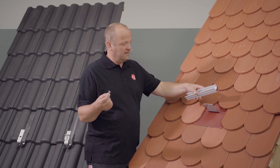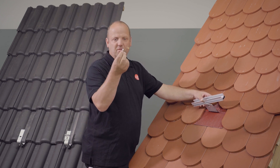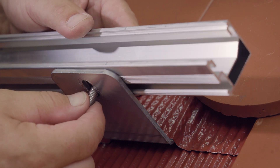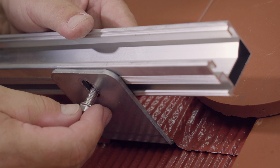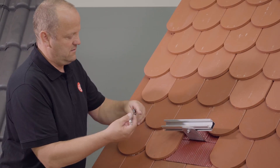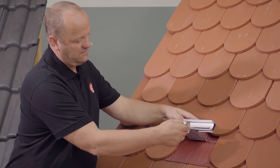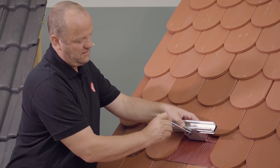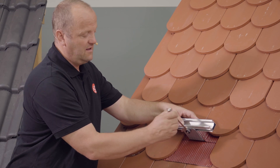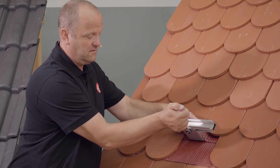The single rail is connected to the single hook plain tile using the eight millimeter hammerhead screw — in this case an eight by 20. Twist through the slotted hole in the tried and tested way, lock nut on top, and dressed. I now have a height adjustment of about 25 millimeters to compensate for unevenness in the roof, so this option is also available.